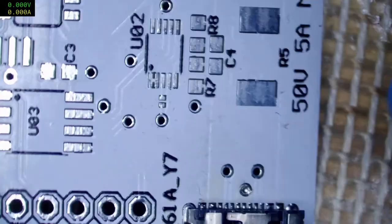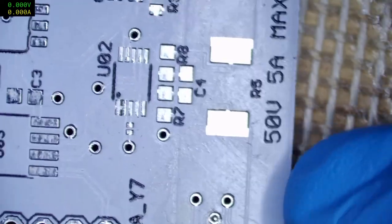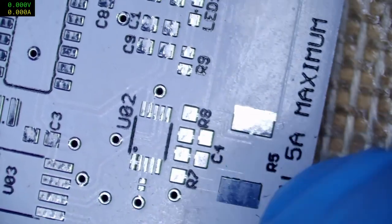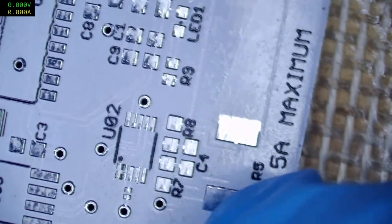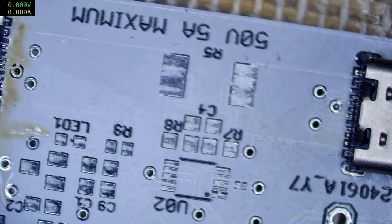The only upside, well I shouldn't say the only upside, the big upside of doing both connectors on the same side is that you don't have to put the power plane, the V-bus line, through vias. Instead it's just simply a planar flood fill either side with the shunt chip in between.